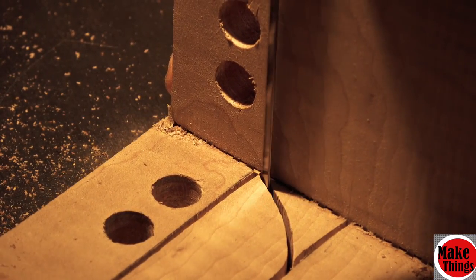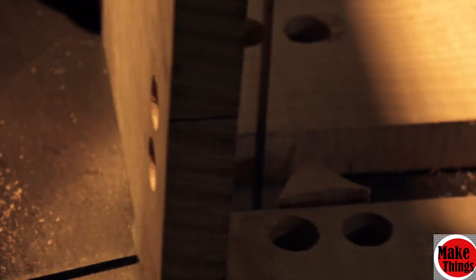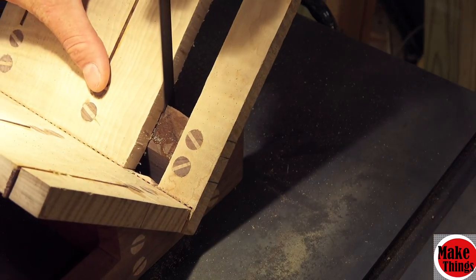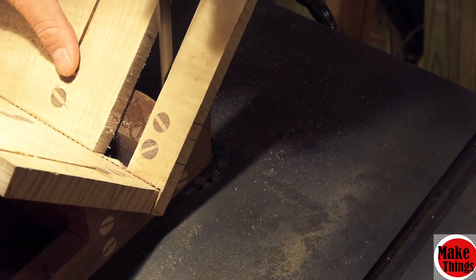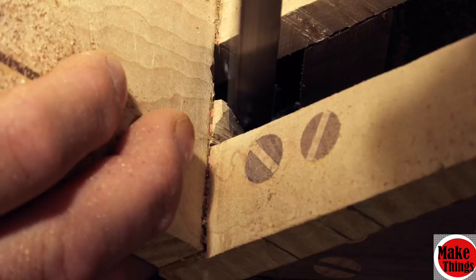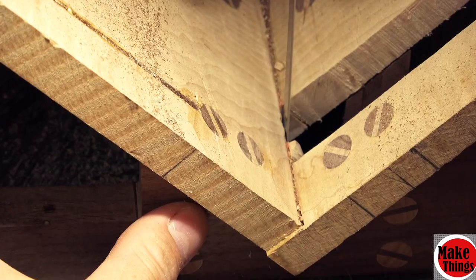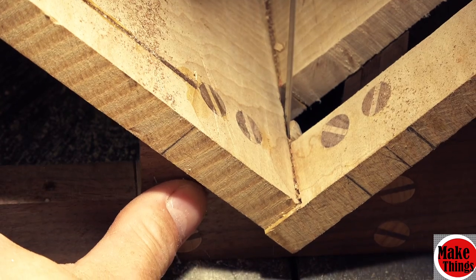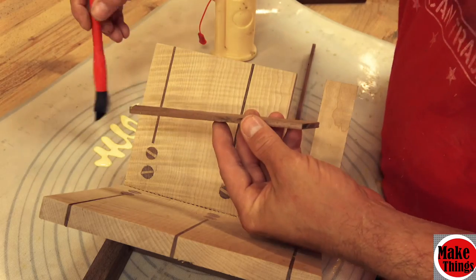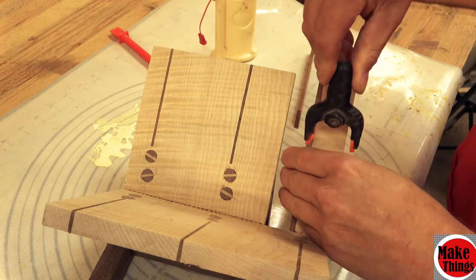If you choose to do this and you didn't use box joints to hold the sled together, I recommend using spline joints to give it strength. Due to the box we created on the base, it was necessary to cut this part of the box out. It was a difficult cut to make, but it was really worth it having the support on the end. I hogged out the rest of the cut, allowing the blade to sit in the direct center of the jig. This is purely cosmetic, but I wanted to get a good highlight to the hole I had created to prevent damaging the opening later on.